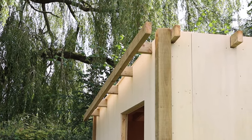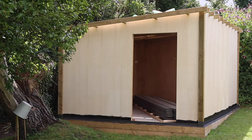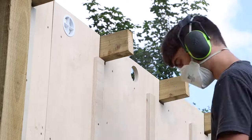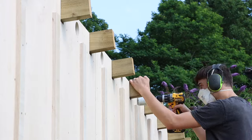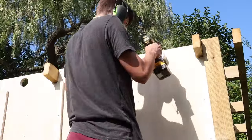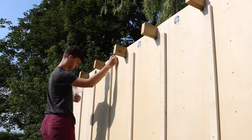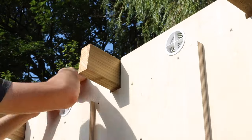Before screwing in the front and back plywood overhang, I need to add vents. It's very important to vent the top of your timber store or shed — in hot weather warm air builds up inside, causing condensation and mold on the roof. I'm adding vents all along the roofline using a Bosch 70mm hole saw, with soffit vents from Screwfix or Amazon fitted into the holes.